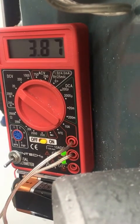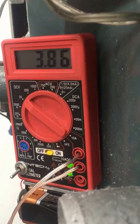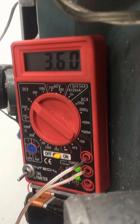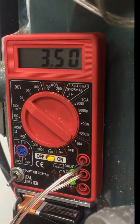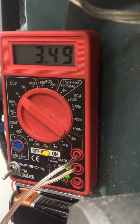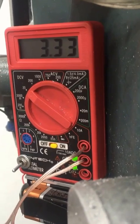Furthermore, there are times when the spindle resistance is essentially zero as read by the circuit. And if you're looking for a touchdown, you won't see it. So it's very important to first look at the numbers and convince yourself that the reading is large enough to detect the touchdown. If it isn't, you just give the spindle a little bit of a twist and it'll pop right up — like it just did.